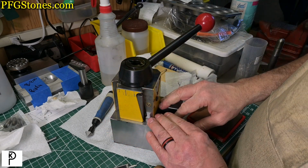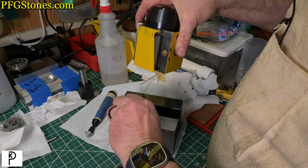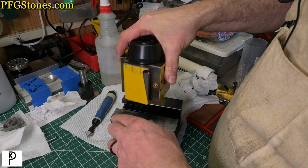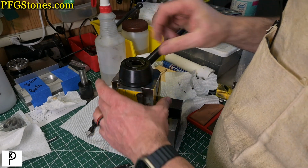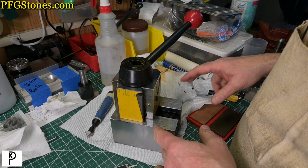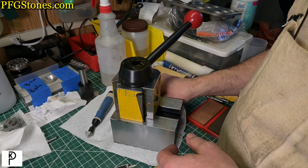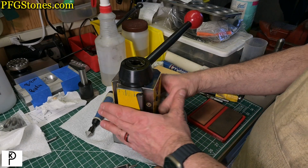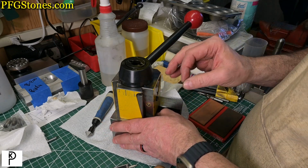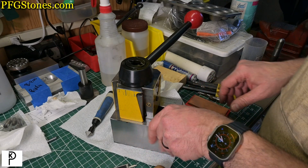But the other feature of this installation is that if you ever want to take the pins out, you could take the pins out and rotate the tool post, although I really do not anticipate doing that. So, nice fix. The next step, believe it or not, is to take the T-nut and stud that we modified, and remove the pins that we glued in.